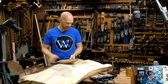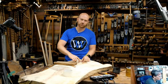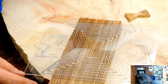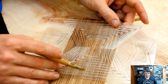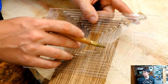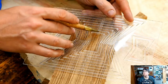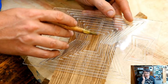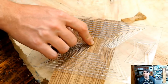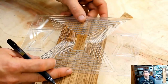So I want to have a slightly larger bow tie, something about 4 inches, sticking off about 2 inches on either side. I can go over to this template and find the 4-inch size dovetail, but the 4-inch dovetail has a pretty tight waist. It's a fairly steep angle. On this one, it's 28 degrees, and I'd like to stick around 12 degrees. The nice thing is I can set this up and use this, except I have to grab my pen. Where did my pen go? There it is. So I can use this to draw out where I want this to be.